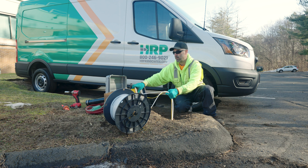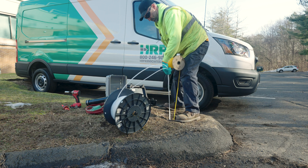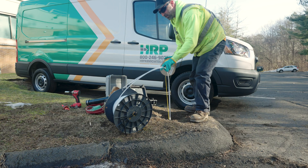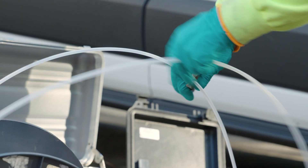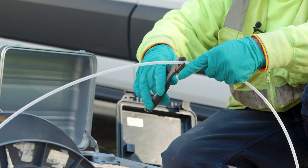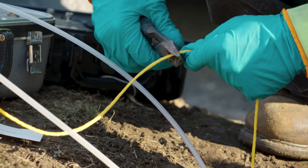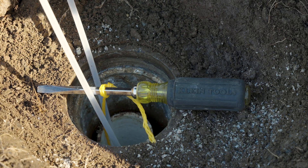So we're deploying the pump. Now we have our pump set to our set depth. We will cut our tubings for our air and water — that one is our airline. We'll connect our air fitting, it's just a compression fitting, it just slides in. You usually leave the water line a little longer so you can go into your containers. We will suspend our pump here by tying it off on our screwdriver at our correct set depth. We're done with our tubing.